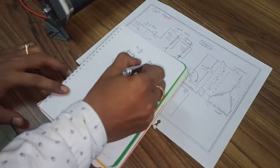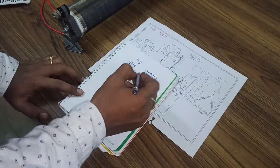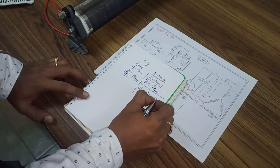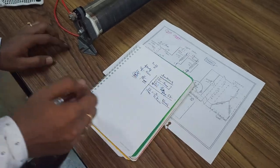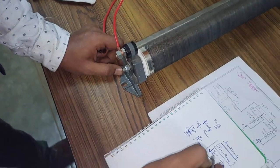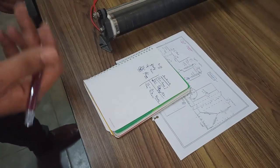When you come to the armature winding, the current I is equal to V divided by R. The armature current initially has to be low. The current should be low, which means you have to keep the rheostat in the maximum resistance position — this is the starting condition. We have kept the input here and we are taking the output. What should be the position of the rheostat? R maximum. If resistance is maximum, then minimum current will flow into the armature and it will start slowly.